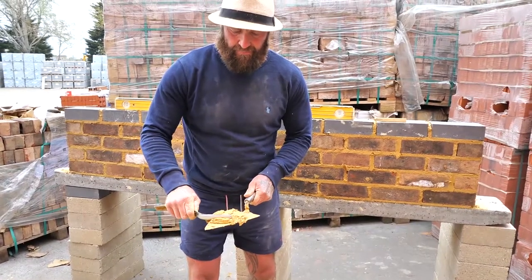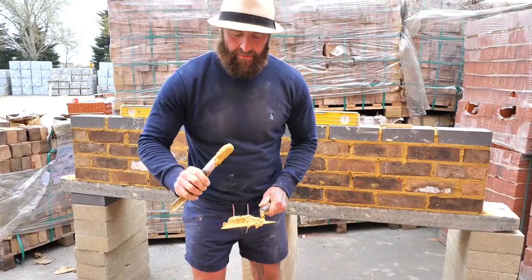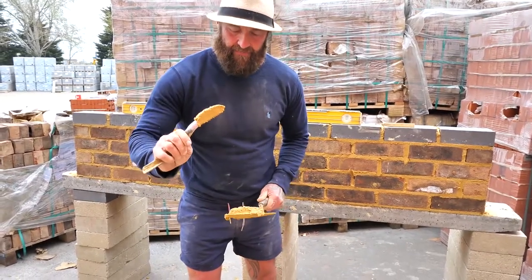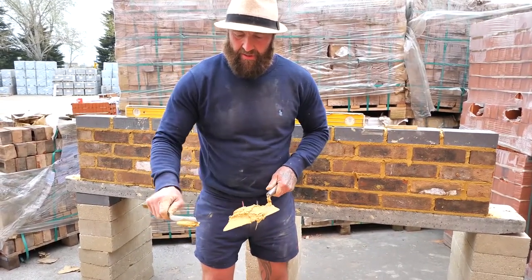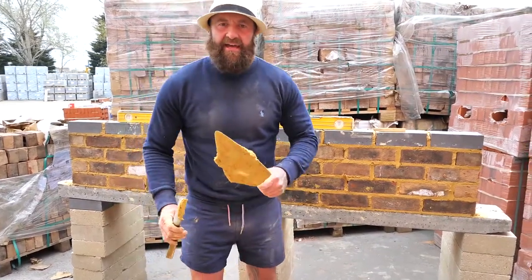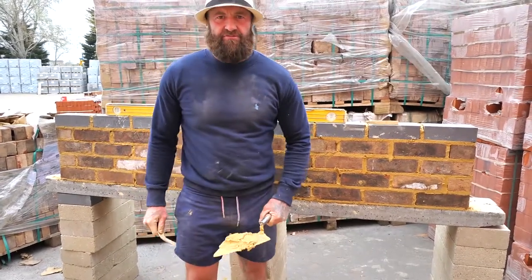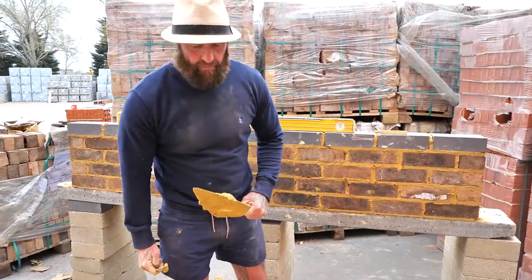Again, push the jointer right into the trowel, so you feel it touch the trowel, and up. Okay, again, there. Otherwise, if you don't push the trowel up, sometimes it stays, but the majority of the time it goes off. So it's there. Again, from the hips, not there. Okay, relax, just relax. So there, okay, good.